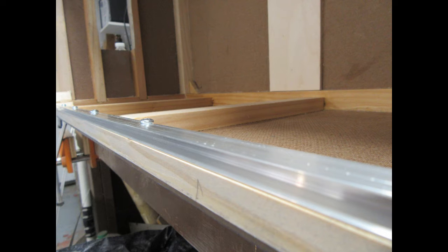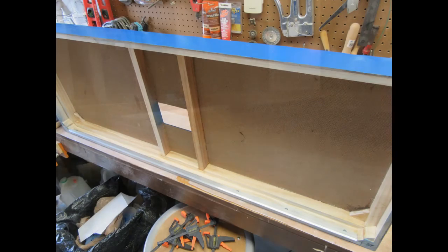The valance is designed to be fit over the edge of a case made from 1/4 inch thick plywood. Since it is not being used that way on this case, I use sheet metal screws passing through drilled holes in the valance into the wooden edge stiffener. 2 of the female valance strips are used, one on each of the long sides of the case.